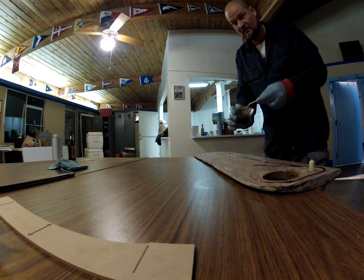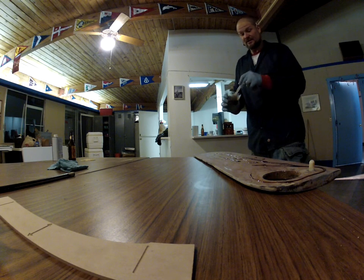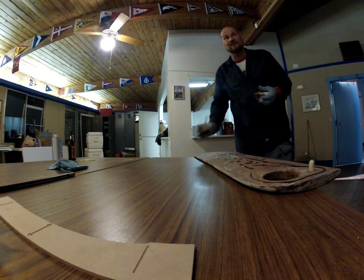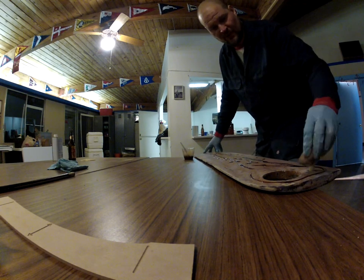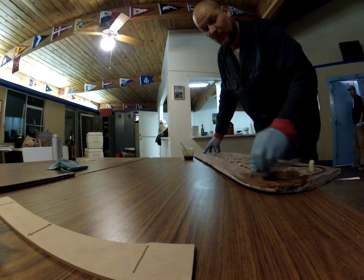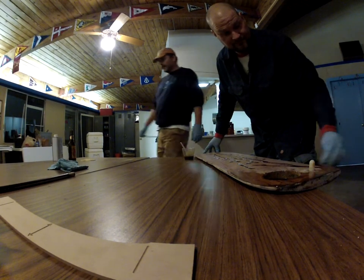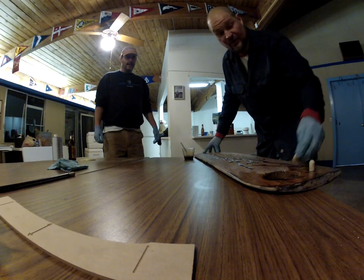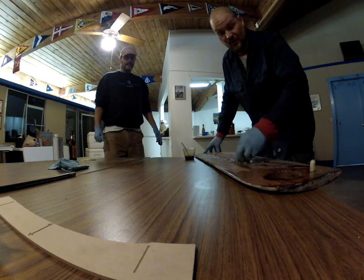So you basically did an epoxy bottom on the 30. And my 4.5 actually. But yeah, the entire bottom of the 30, when I'm done with it, will be epoxy, and then paint over top of that. The reason you have blisters is because of gel coat, because gel coat's a way inferior product. It's way more porous than this and nowhere near as strong. It's really brittle. That's why, instead of gel coat on the bottom, I'm going to epoxy it and then paint it, because overall it's going to be a stronger surface.